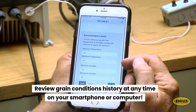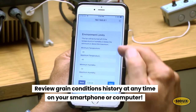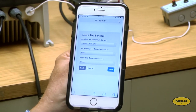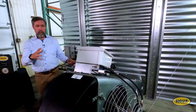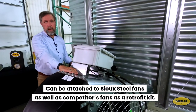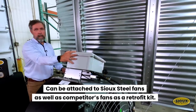On top of all that, the history is also provided to you. As you're cataloging data with these units, it's being put into the software so you know the temperature and humidity of this particular location where the bin is, and you also know the history of the fan running and the heater providing gas and burning — so you know what you're actually using. This can also be mounted on all the other standard fans that any bin manufacturer provides.